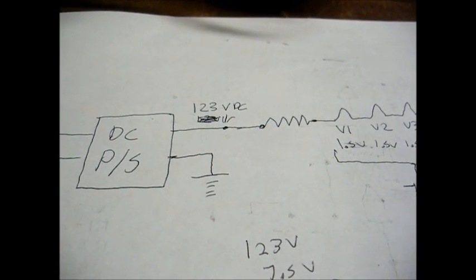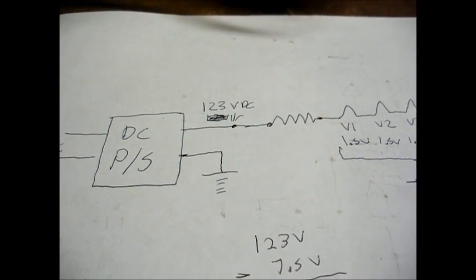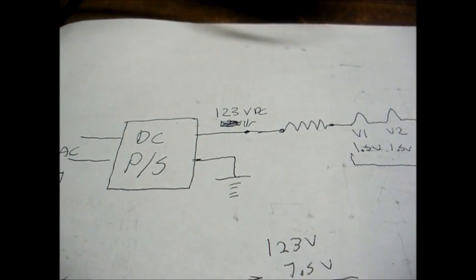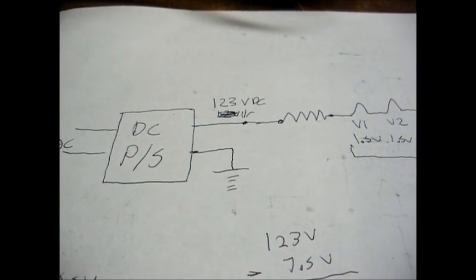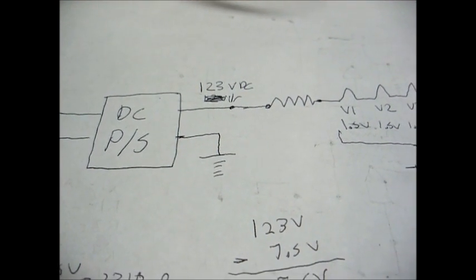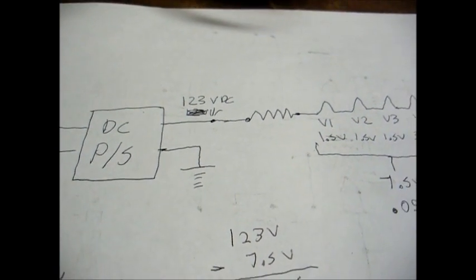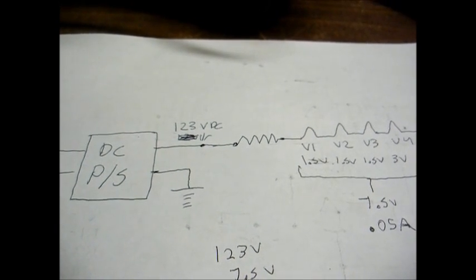Okay, what I'm about to tell you now is not really going to be needed for this radio, but let's say you have one of the older 1930s radios that uses what they call a curtain burner power cord or a ballast tube, and let's say that the power cord or the ballast tube is defective. Now, in the 1930s, we didn't have the high voltage tube filaments like we had later in the 40s and up. You know, we didn't have 25, 35, and 50 volt filaments.